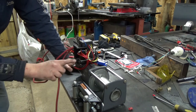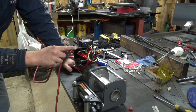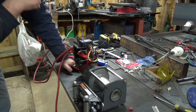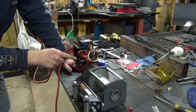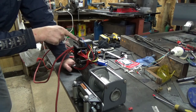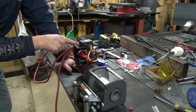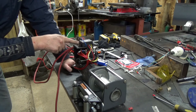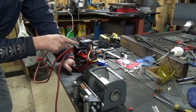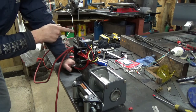So base plate, then I have this plate which is a U channel or C channel with a section cut out which slips around the relay itself. That has two holes drilled into it, which has two silicon rubber insulation sleeves from recycled ignition coils out of Vauxhalls or Citroens. I think they're Citroen ones. One Citroen, one's Vauxhall. So I've recycled those as insulators and grommets.